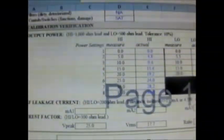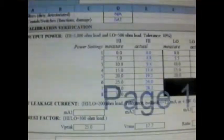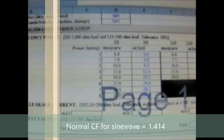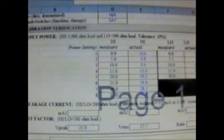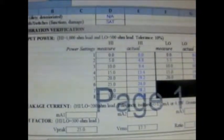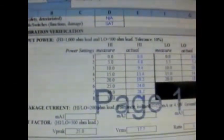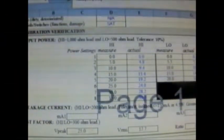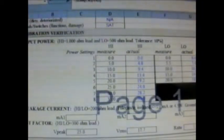Another way is to utilize the RF current multiplied by resistance to calculate RMS voltage. A higher-than-normal crest factor implies some degree of impact such as component wear, higher impedance, noise, or waveform distortions. Document high crest factors for coagulation, which is normal, and low crest factors for cutting, which is also normal, as well as any distortions or noise.